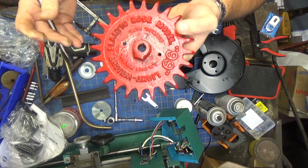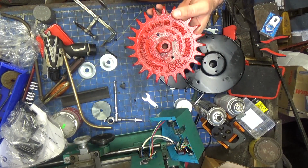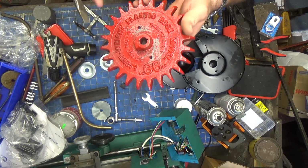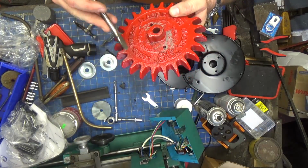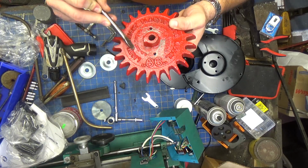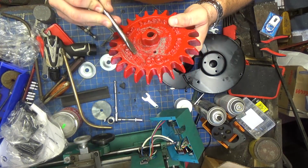I go through and clean these all up. I buy the right paint, Rust-Oleum. It's got relatively good reviews most of the time. I sandblast it to bare metal. I clean it with solvent. There's no residual. There's no oils. There's no grease. There's nothing on here. I hit it with a self-etching primer. Let it dry. Do everything that I'm supposed to do, and this stuff flakes off of here like it's icing on a cake. It is just so frustrating.